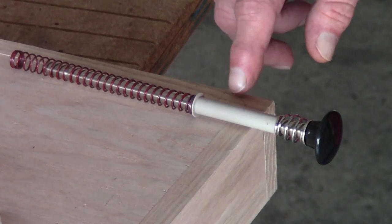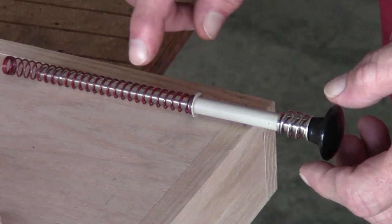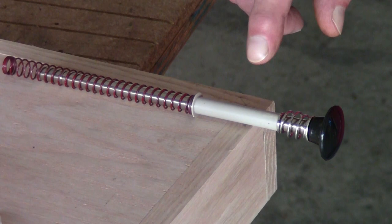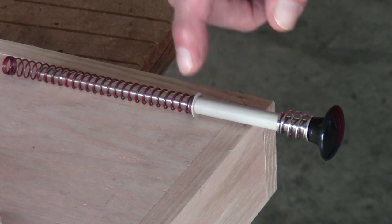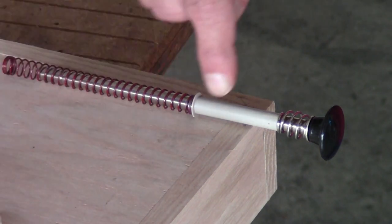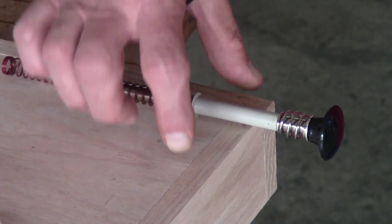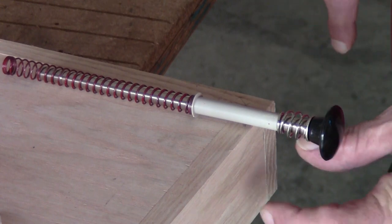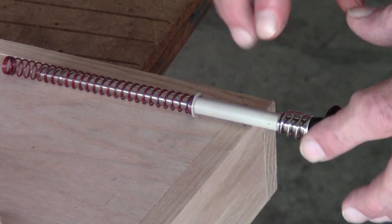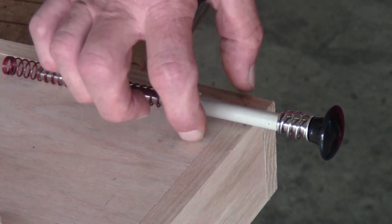All right, next step is, if you noticed, this comes with a sleeve here. Now, this is the guide for this, so I gotta support that whole sleeve, so I'm gonna take the 1x4, I got about 6 feet left of oak. I'm gonna go ahead and cut it down to one piece that goes all the way across at 20 inches. Then I'm gonna cut another piece about 3 inches long this way, take up this space. Then another piece that comes down so I can strap it here and give this support when you pull it back. Okay, so I'm gonna rip the 1x4 in half. That'll give me the full length of this one and the full length of the back one. And then I'll cut two little pieces off for here.